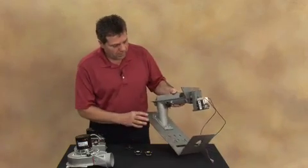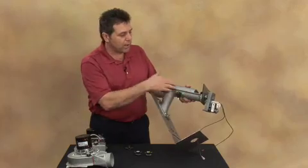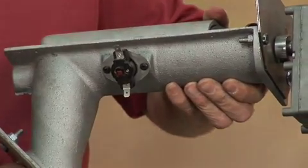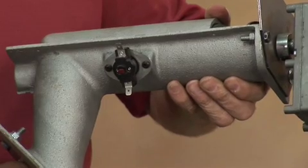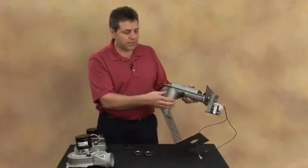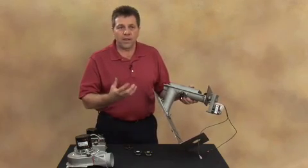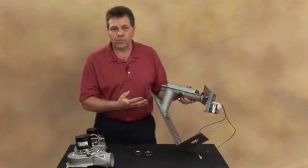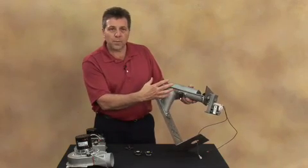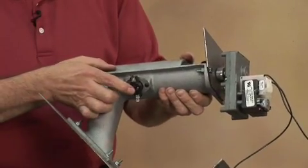Here's an example of the manual reset high temperature sensor located right on the auger housing. If you ever have a burn-back situation or the temperature gets too hot inside the hopper, this disc will disengage, the button will pop out, and it will shut the auger system off, putting the unit into a shutdown safety mode. To reset this and get the system running again, after checking to make sure there are no problems with the system, push the button in and the system will once again engage.